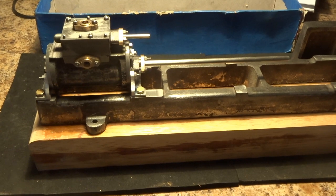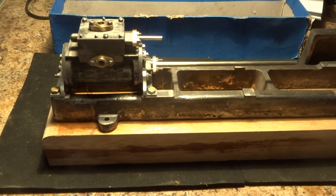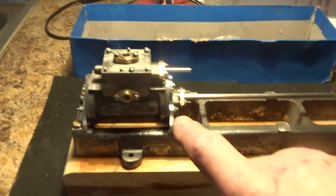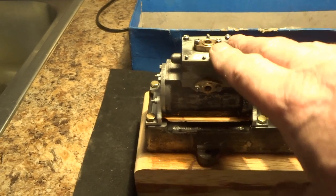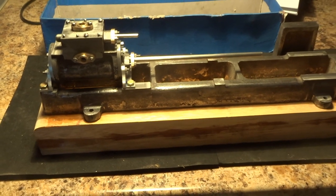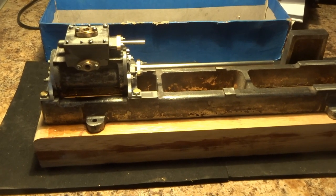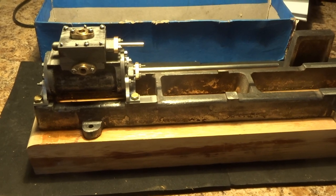The cylinder assembly is almost finished. There aren't any gaskets under any of the covers as yet, nor have I made the slide valve to go into the steam chest. That might be the next job. But the holding down brackets have been fabricated and the whole assembly has been bolted down to the bed casting using 3BA bolts. The drawing called for 4BA, but 3BA suits my purpose better because I seem to have a surfeit of them and you hardly ever use 3BA, so I used 4 of them up, so that was good.